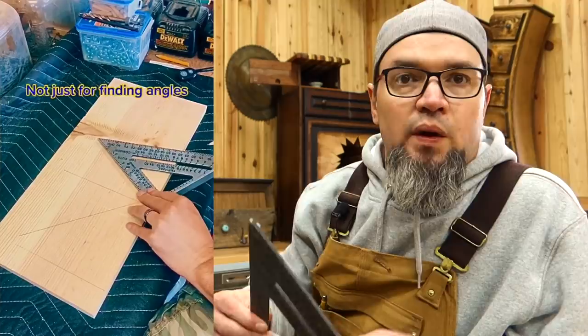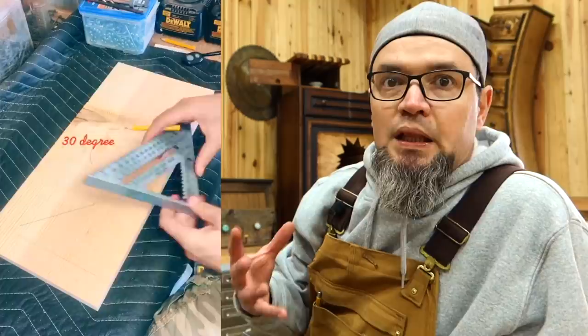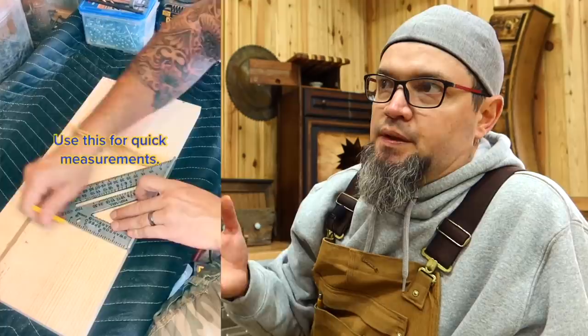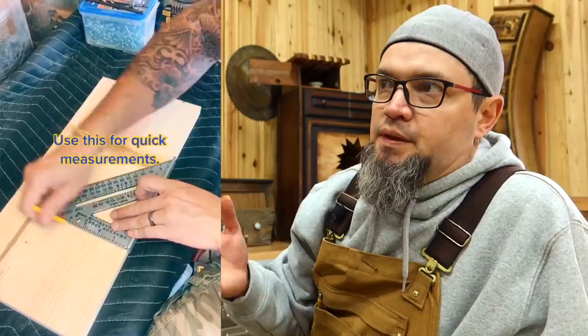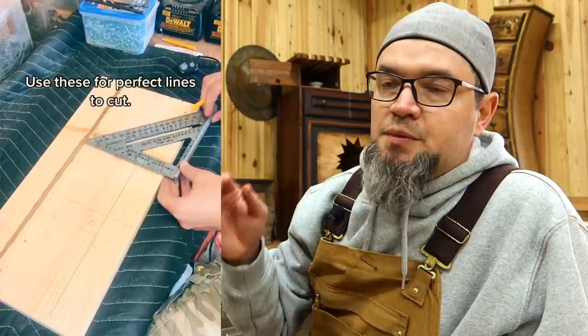One of my favorites is the one about speed squares. Speed squares are one of the handiest tools you can have in your tool bag — so many different uses that people don't even know about. Workers assume speed squares are just for framing, but that is not the case. In this video I show several different things you can do with them: you can find angles using the pivot points, there are little tips about what the cutouts are for — like this diamond, which is exactly three and a half inches from the end. Put a pencil mark in there and that's a stud width. The teeth on the Swanson are set up to hold the tip of your pencil for making straight lines down your boards. It's not just for 45s and 90s — there's a ton of other uses. Handiest tool in the bag.